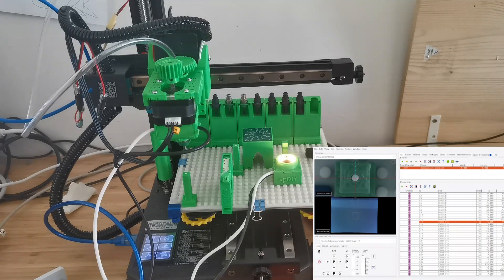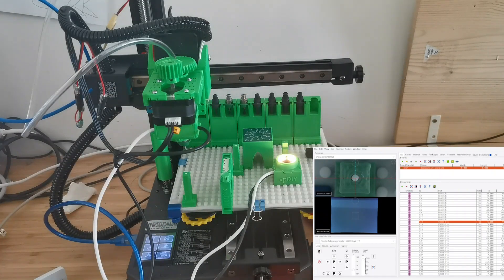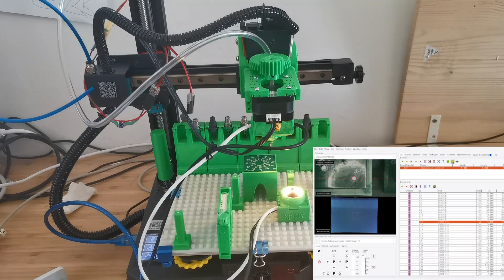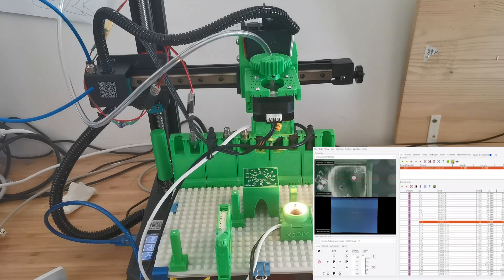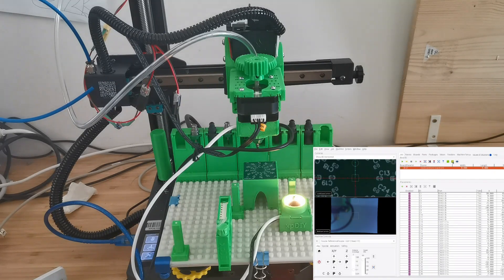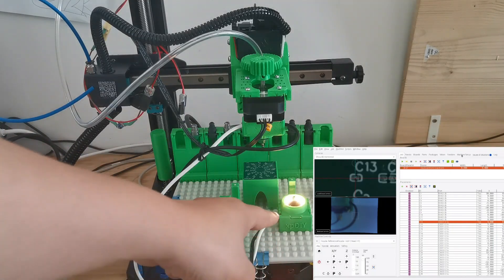Because of the lighting it's much easier to identify the fiducials on the board. I'll let it recognize the fiducial — just press this button. You can see it nicely lights up the fiducial and the color of the fiducial is very even. It's being centered to the board, and you can see the fiducial has located the board, which is very good. This lighting helps a lot. I didn't build the operator for the bottom camera since constant lighting there is also easier to identify components.